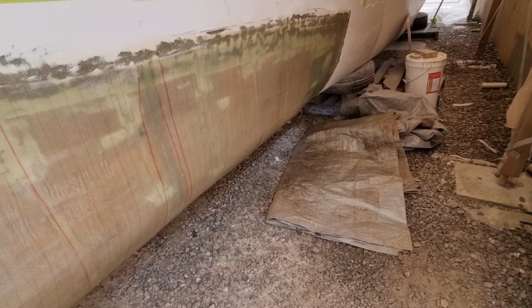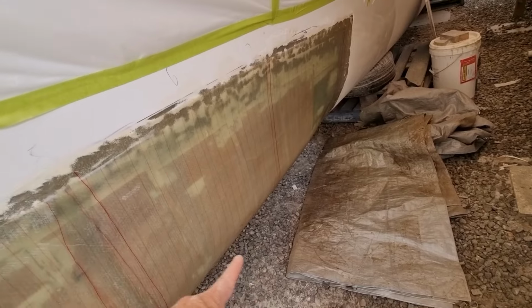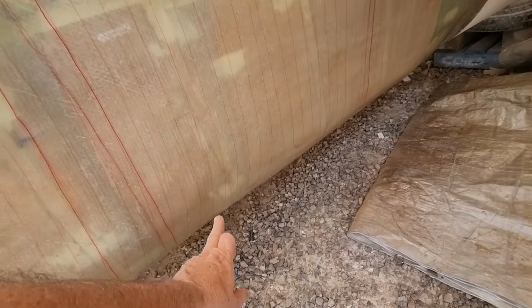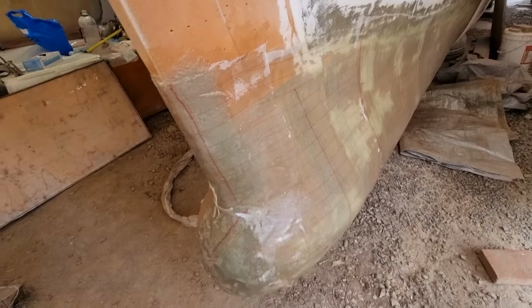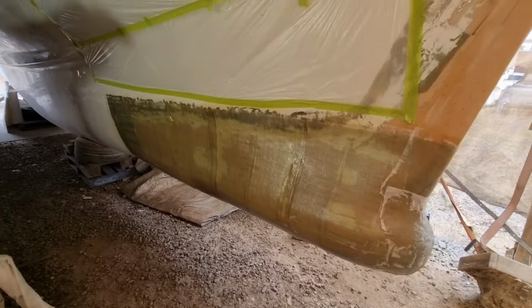The second layer then is able to be laid, and what we did, we actually cupped underneath, and then cupped back underneath again, and we've gone right through it all about here. So the actual hull line is six layers of 600 double bias, and the bulb, well, it's an icebreaker. I reckon that's 10 layers of 600 double bias right on the very bow, and it's a bit messy under there, but nothing a bit of sanding won't fix. And that is done now. So all we need to do really with that now is to barrier coat it and anti-foul it.